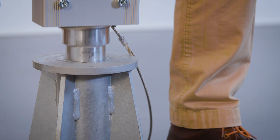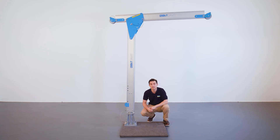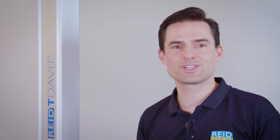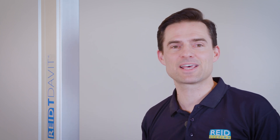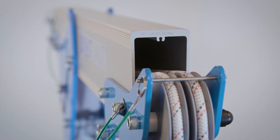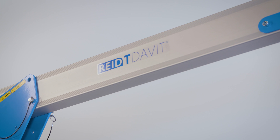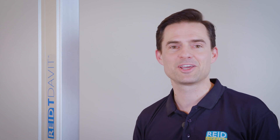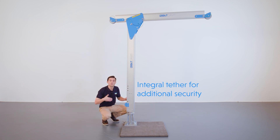The davit is designed with a 65mm kingpin, which incorporates two patented bearings, enabling rotation even when the davit is loaded. The product is manufactured from marine grade alloy, which is anodized or powder coated to provide a quality surface finish and a good level of corrosion resistance for even the harshest environments. The product is quick and easy to assemble using retaining pins, meaning no tools are required. For detailed information on assembly, watch our T-Davit assembly video available via our website. Fixings are zinc plated as standard, but we can offer a full stainless steel fixing upgrade as well as a marine specification upgrade should that be required. The davit comes with an integral tether that secures the davit to the socket, ensuring that the davit cannot be removed without at least two consecutive and deliberate actions.